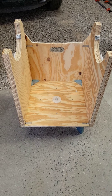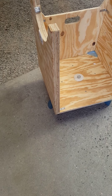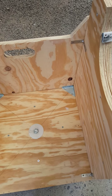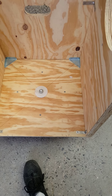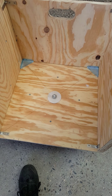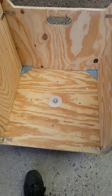This is the base with the telescope off. The sideboards are glued and screwed together, and I also put L brackets and corner brackets in to stiffen everything up and make it more rigid. There's a center bolt here with a plastic washer I made from the barrel. When I cut holes in the bottom of the barrel for collimation, I kept those pieces and drilled them out to make washers. That worked out really well.